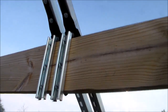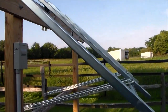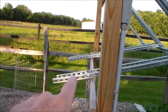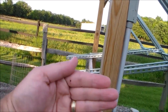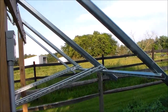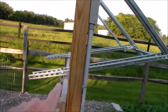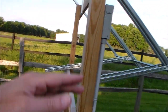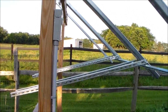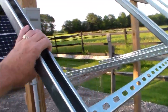With it that way and with the hinge on top, I should be able to change it with the season. Right now I've got it in the spring and fall configuration. You'll notice back here on the braces I've got enough room to push it more this way, which would cause a greater tilt closer to the 90-degree angle I would use during the summer time when the sun's directly overhead, or I can pull it back this way which would increase the angle for when the sun's lower in the sky during the winter time.